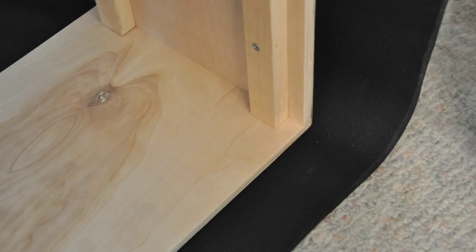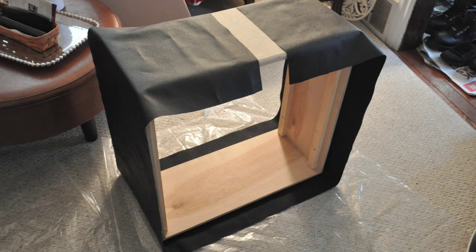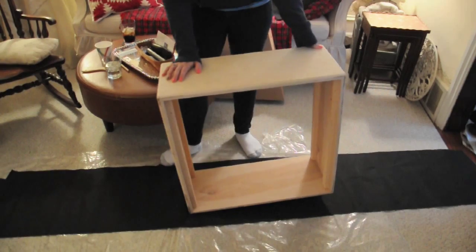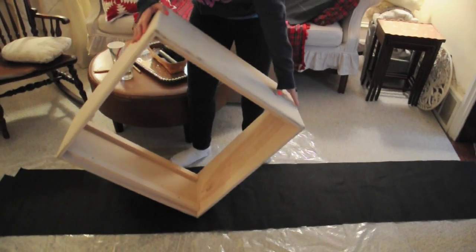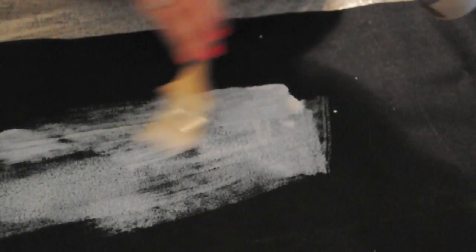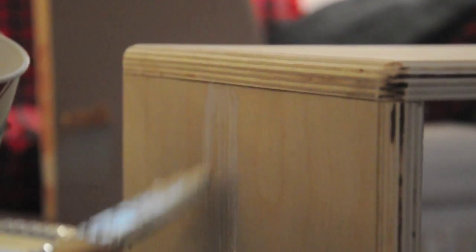To figure out the pieces, I placed the cab in the middle of my large piece of tolex a few inches from one edge. You want enough excess to wrap around the edge of the wood and a bit into the cab. Since the piece I used was slightly too short to reach all the way around, I kept the cab in place top down and laid the tolex flat as one long strip. After tracing around the edge of the cab on the tolex, we rolled the cab over on its side, keeping it the same distance from the edge. We applied tolex glue — a latex glue that's great to work with — to the tolex within the traced lines and the cab. After letting the glue set for about a minute, we lifted the glued part and smoothed it firmly onto the cab from one side to the other, then repeated the process for the remaining sides.